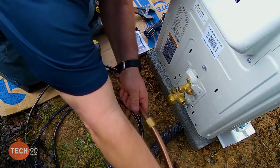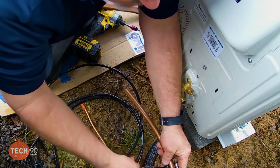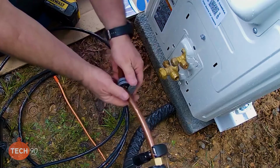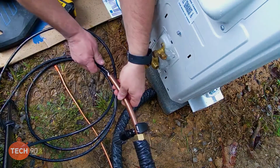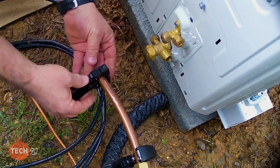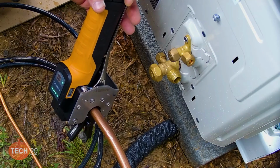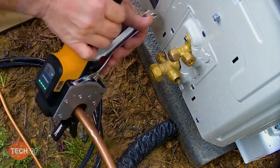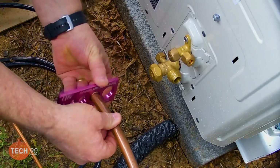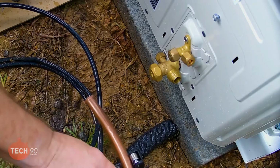My flare nut. Slide that back. Grab that tubing cutter. That works pretty slick, don't it? It's ready to go when you are. Got you a marker. Let's see how I did. Perfect flare. All right, so our adjustment held. Yep. For the 5/8. We'll find out on the quarter.